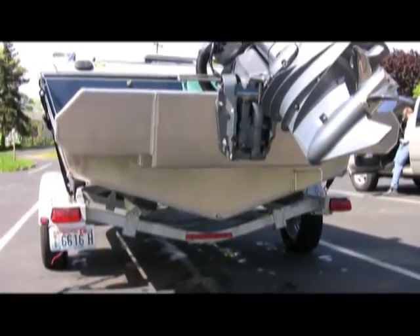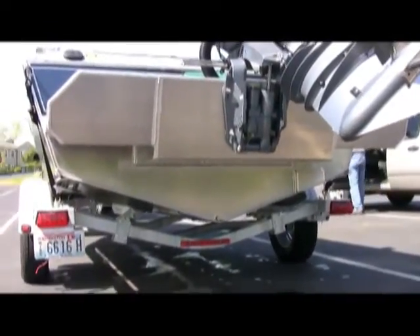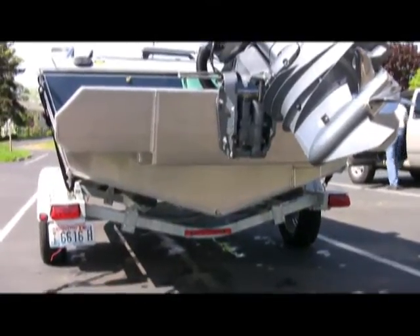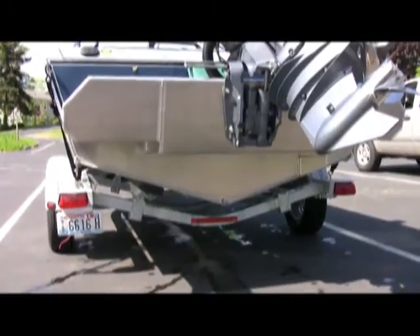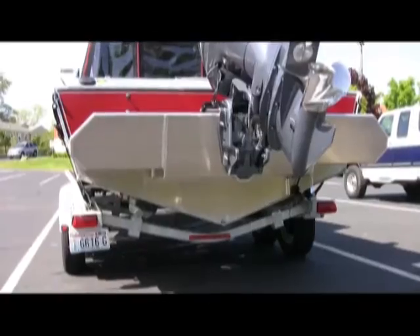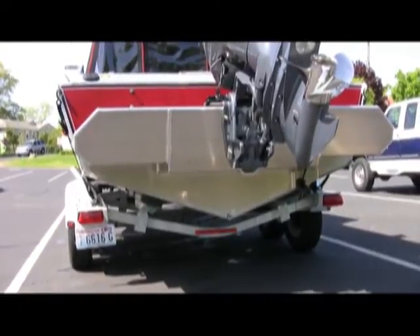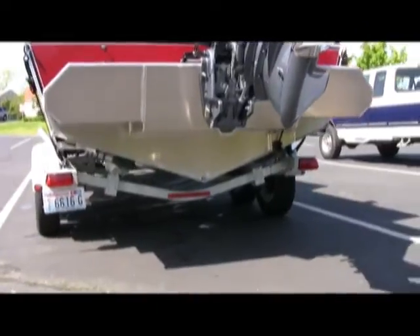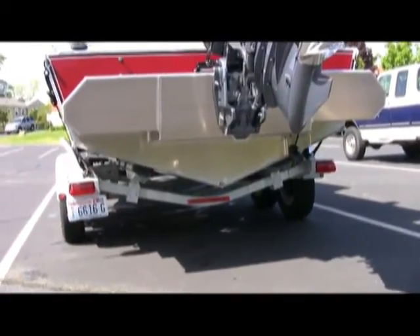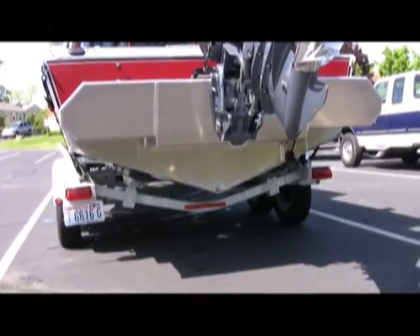Here's a look at the rear of the 17 Sport Offshore — you can see that full-width bracket and the displacement box underneath, which helps displace the weight of the engines when trolling or mooching. The flat box pushed underneath the water really adds stability. This 17-foot boat has a 6.5-foot wide bottom — very stable — yet still has a respectable V: 16 degrees at the transom up to 30 at the bow. Now looking at the transom of the 20-foot Super Sport Offshore, you can see the bracket runs full length across the transom. You can mount a kicker or ladder on either side, with the displacement box underneath — and that deep V: 18 degrees dead rise at the planing surface, up to 40 degrees at the bow.